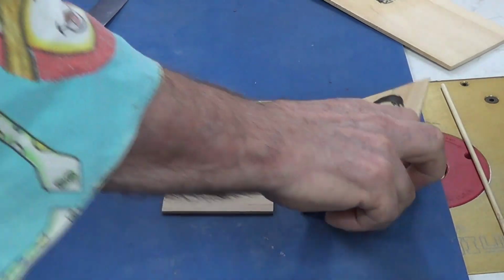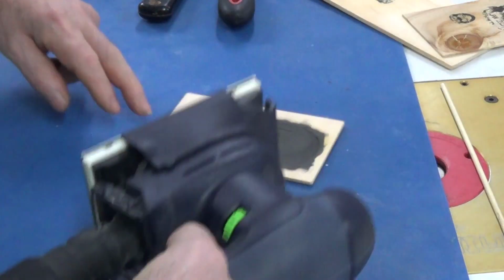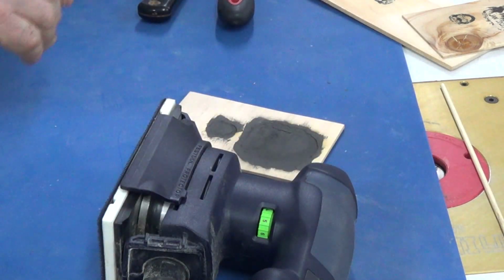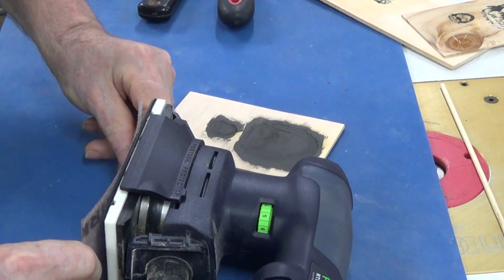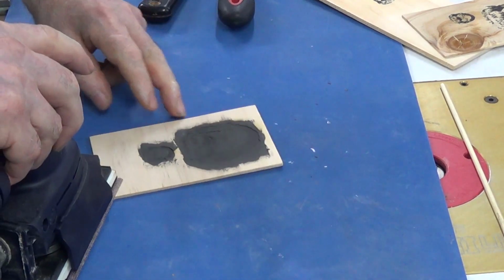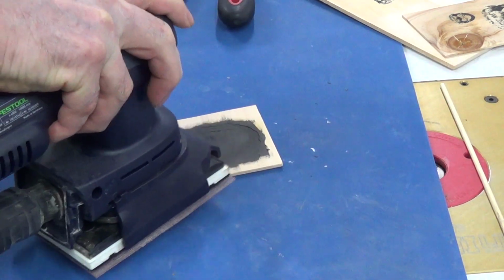It's AM now, and it has dried quite well. I'm going to give it a light sanding, come here, of 240. All I want to do is basically remove or flatten out the wood filler, so I can then, what am I trying to say? So I can then give it a second coat. So just a quick pass over.